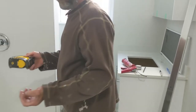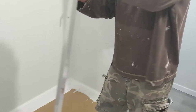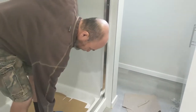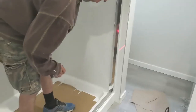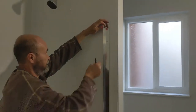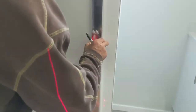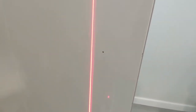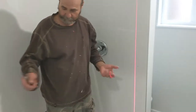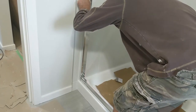The next step — I have a laser, but if you have a level it will do it, just to set up the track. I grab one, two — this one just goes right there, you see how it fits right on top. Then I have my little mark in there. I put my laser, cut it up on the inside, bring it to the laser line. Now all I do is mark right on the center, then I do three marks. Then I can move this, put it this way, and do the same step on the other side with the other track. I just flip the laser over, go to the track, put it on my little mark, set up the laser again, then do my mark.